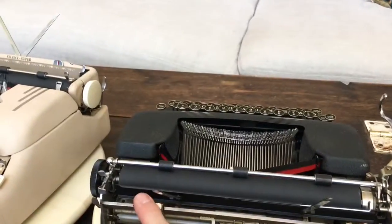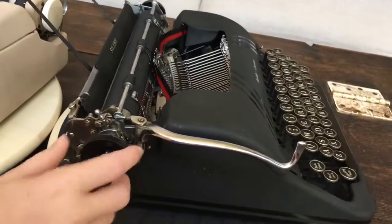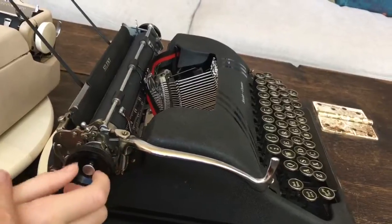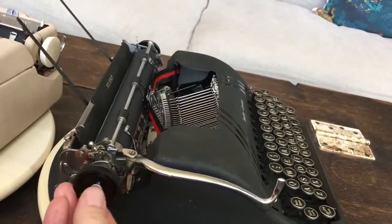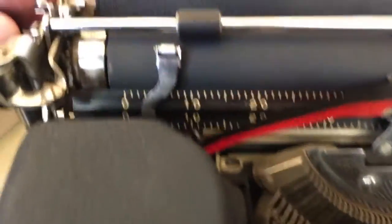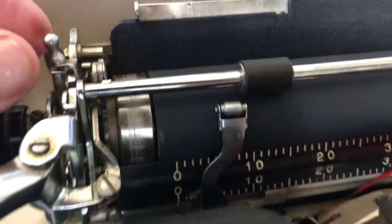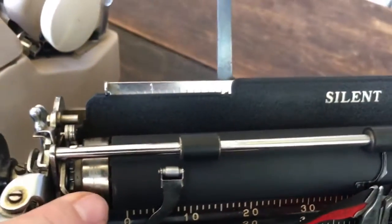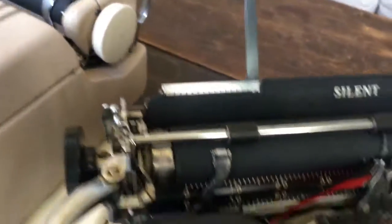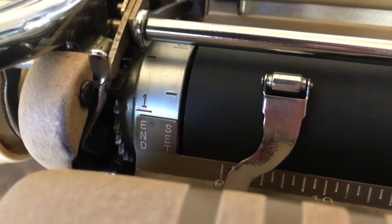The buttons are different but the mechanism is the same — you just push and slide. Over to this side, we have the platen knob again, and the carriage release lever. You pull that out so that you can get to an exact place on the form — that releases the clicks. Over here, it's not marked as well as on the '56 model, but you have the line spacing for single space and double space. You'll notice that there's no page gauge on the '46 model, so at some point between '46 and '56 they figured that out. Oh, there it is — the page gauge. You can watch the video review of the '56 models to see how that works.